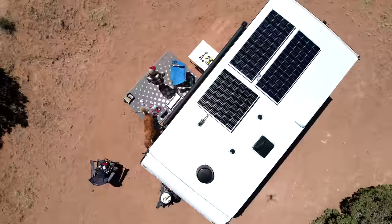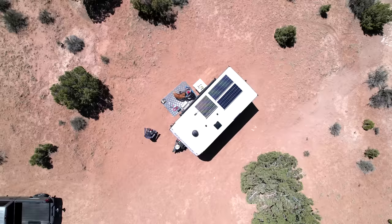As Kat just mentioned, we're all finished up on the roof and moving on down to installing the other components of the solar system. The panels are wired. For the Keystone Mini owners, the wiring that was supplied from the roof jacks down to where the existing solar controller was is sufficient to handle a lot more solar. So that part we could use. Everything else will need to be either added or replaced, upgraded. So what we have done is installed a new solar controller that will handle the 620 watts that she has on the roof, and put in safety devices, etc. We're going to show that to you now.